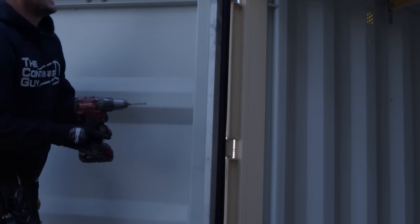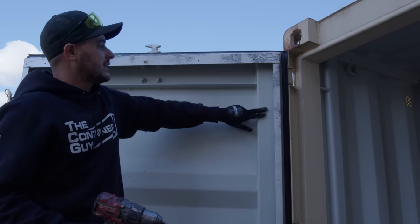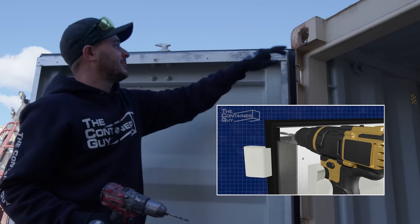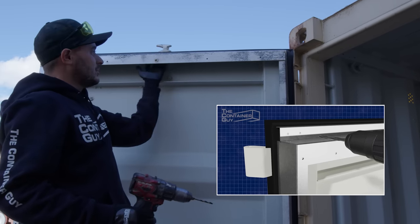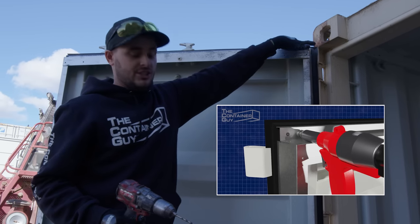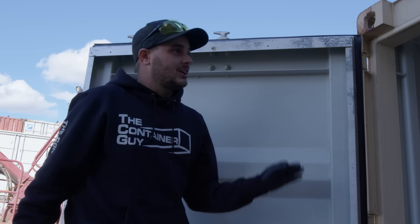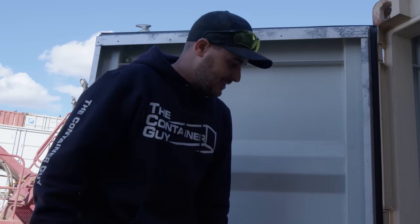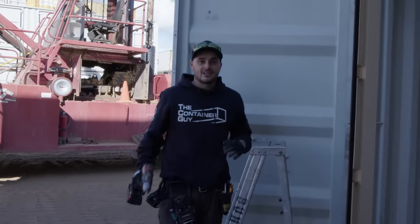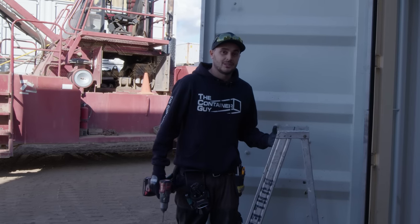If we jump up top, the one return fold here is what allows this kit to hook onto the top of this two-by-four rec tube. Then there are holes over here — previous kits had holes, but they'd be rogue holes not going into anything, and spray foam would actually fly out of there. So another revision to the design: we only secure it into the hollow sections, very similar to our steel stud brackets where we're only going into the top 60-millimeter tubing of a container. This ties all of that together and allows you to insulate your shipping container doors, keep them operational, and gives you the best vapor barrier possible.